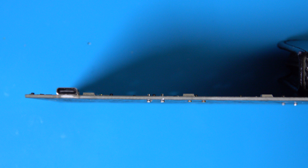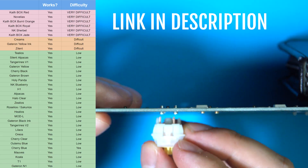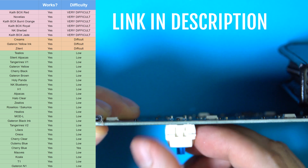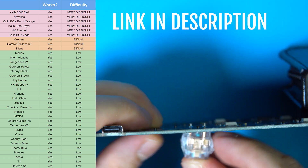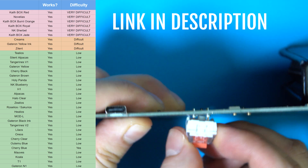Now onto the switch compatibility test. I've got a 305 socket on this slot and a 7305 socket on this one. I'm going to grab as many different kinds of switches as I can find and test them for compatibility. Here's a timelapse and a table with the results of testing 34 different switches on both of these sockets. The results are grouped by level of difficulty, with the most difficult shown at the top. Every switch I tested worked on both, so I believe they have identical compatibility.